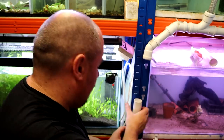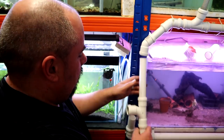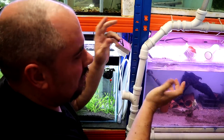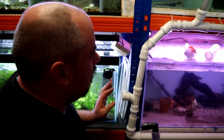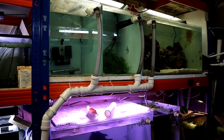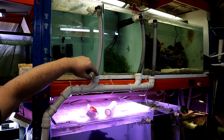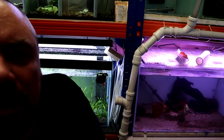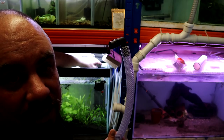Allow a few drips — there we go, that just slots in like this, basically. These are just compression fittings, none of this is welded in, because it's just very low flow, just trickling out of the tanks and down to the drain. I'm going to cut a little bit of pipe — up on these I'll show you. You can see all the other tanks basically have a little bulkhead, a little elbow joint, and a piece of tubing that goes into the drain. I'm going to replicate that over here. But this bulkhead is the wrong way round, so I need to turn that round, fit this, and we're good to go.